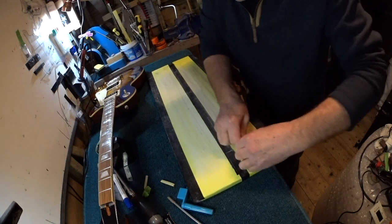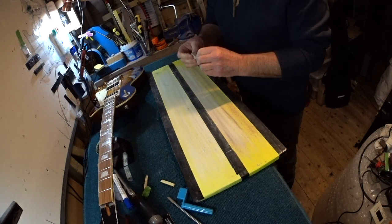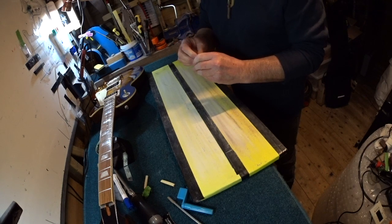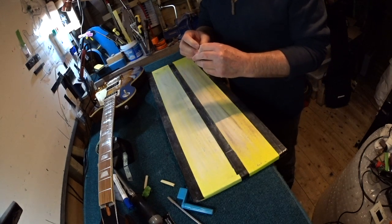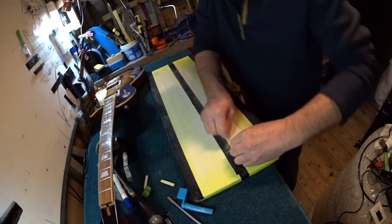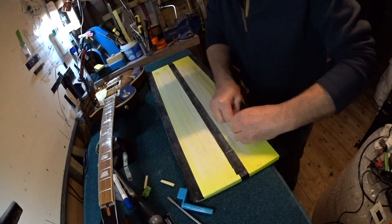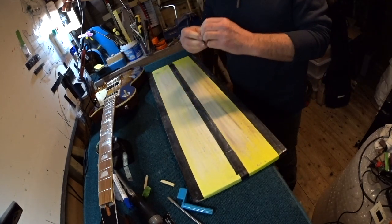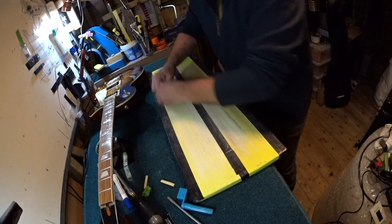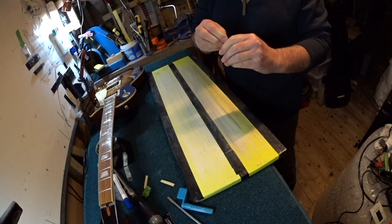Again, I need to really replace this too. So we've taken some material off. Don't quite know how much, it's a bit of a guess. What we're looking for is a straight line. The way that's going to sit right there like that, and we need a bit more off the back here. Sometimes you just let go of it like that, and the hand goes skidding away. Okay, let's have a look. Right, that's looking quite nice. And then, if anything, we just go and flatten it out and smooth it out on the bottom here. Then double check the perpendicularness.